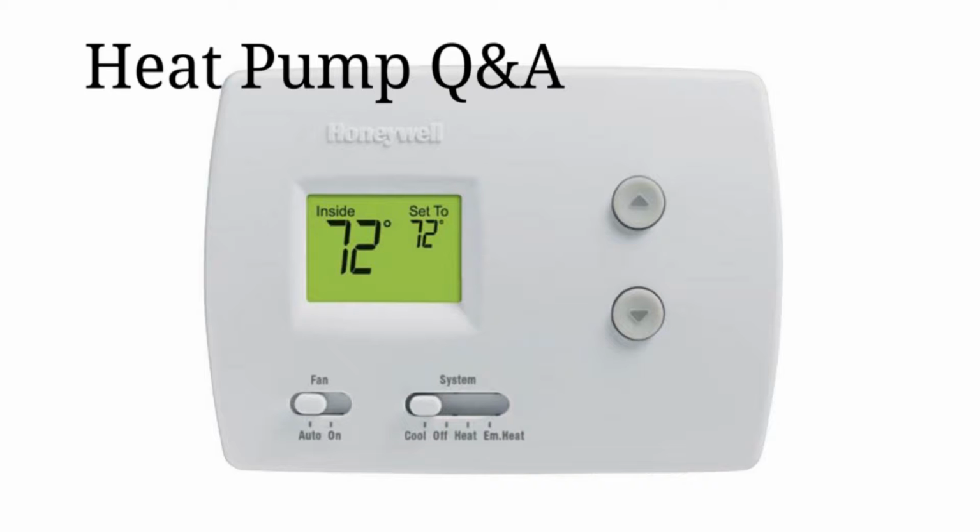So basically, once the air outside is too cold to heat your home inside to your desired temperature, the auxiliary heat, or AUX heat, is going to come on, and it'll notify you on your thermostat screen that the heat strips are turning on to help better heat the air to your desired temperature and move that hotter air through the house. That's why a lot of our tenants had been complaining of warm, or warm-ish, air coming through their vents, which indicated to us that the heat was working, but it wasn't necessarily working the way it should.